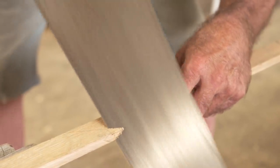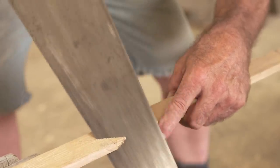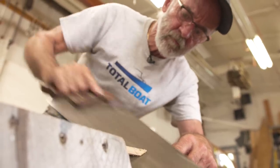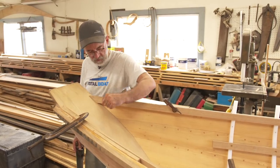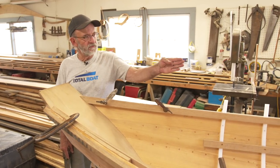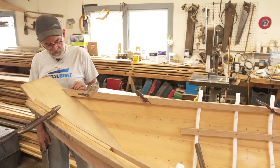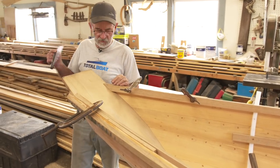It would have been too difficult to make this cut with the in-wale clamped to the boat, so I had to remove it and drape it over a sawhorse. That way I'm able to cut it very close to the line without messing up. Basically I've got the in-wale clamped in position, butted up against the breast hook forward, clamped all the way through the boat and butted into the transom. I've sawn it off a little crudely but not too bad, and now I'm going to do a saw fit.